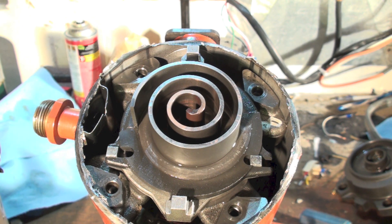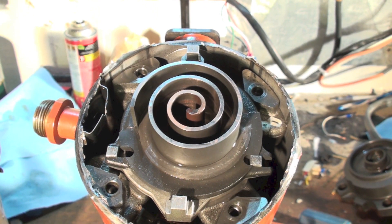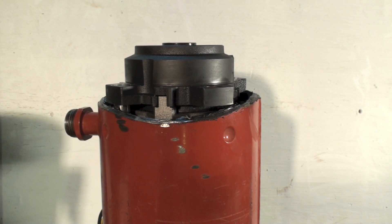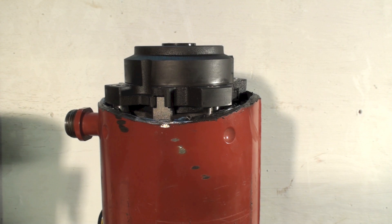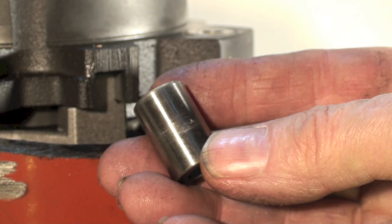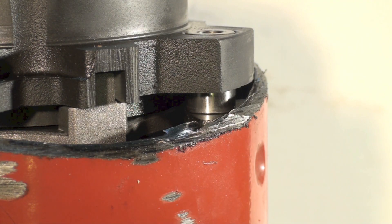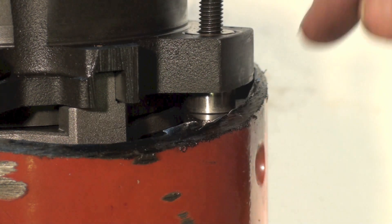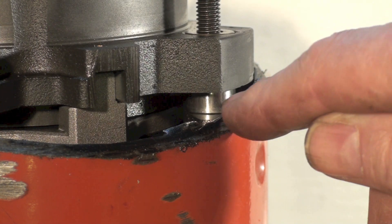I showed you the copper plating on this one — that actually stopped it from running. Let me show you the top scroll and one other thing I wanted to point out. There are four sleeves — they slide down like this — and there are four bolts that go all across there. If you look close at those sleeves, they are machined and have a clearance fit into the holes they go into, and the bolts go right down through there.